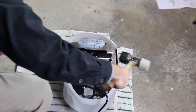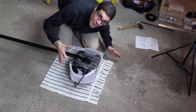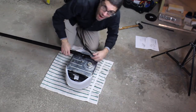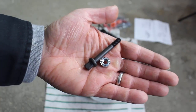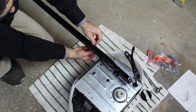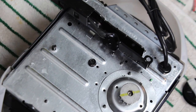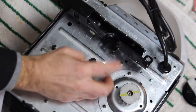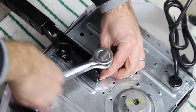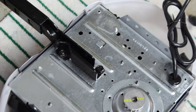Put the U-bracket in place. If you have trouble, you can use a rubber mallet to tap it onto the rail. Take the ¼ inch bolt and lock washer and nut, put it into the rail, and tighten it down. Now there are a nut and a bolt on the top of the garage door opener itself — loosen them using a socket wrench. Place the U-bracket over those holes and tighten it down to the garage door opener using that same socket wrench. Make sure that they're nice and snug — don't over-tighten them, but make sure that they're nice and snug.